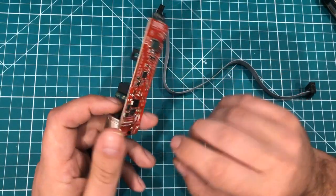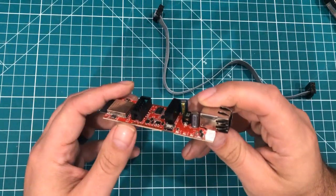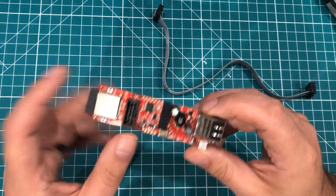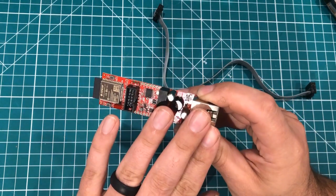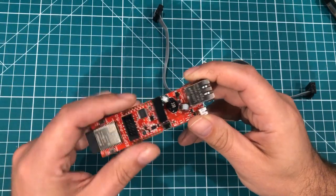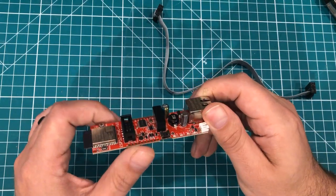It's got a built-in SD card, and these things make really good industrial and connected devices. I'm going to do a video about this specifically going forward. I forgot to tell you the ISO part — there's some electrical isolation between the Power over Ethernet, because you've got 48 volts coming in there, and the rest of the board. They do make one without that isolation, but in my environment I want to have as much electrical isolation as possible.